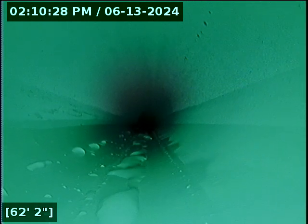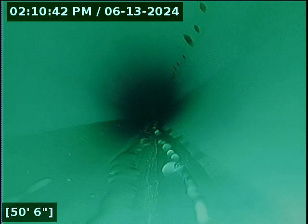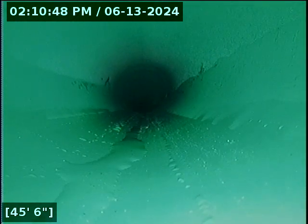The only thing you'll ever get that consistently hangs up in standing water like that is if you're dumping just tons of cooking oil down the line, dumping your deep fat fryers down there, and that's going to build up grease anywhere else in the sewer line too, but it'll concentrate more so in those locations. Otherwise, in an area like that, not that you should put things like paper towels down your pipe, but a paper towel, an improper item like that, would travel through that area just as easily as it would where the grade is actually absolutely perfect. It's just that minor.